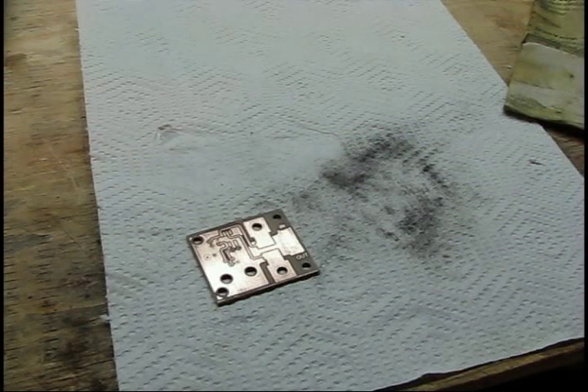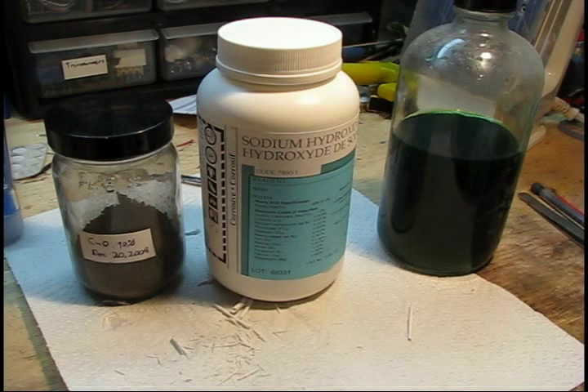So experiment, learn, and have fun. Another issue I wanted to address was disposal of etchant after you're done etching, or when your solution has become too saturated. With ferric chloride etchant, disposal is tricky because you have a mixture of both iron and copper compounds in solution, and it's tricky to extract each one and dispose of them properly or reuse them as useful copper or iron chemicals.